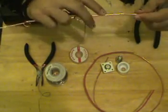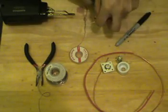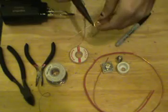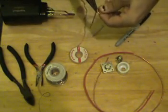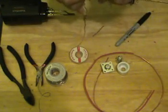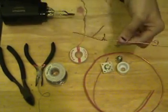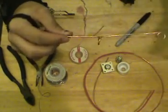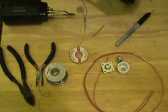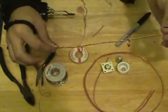I've got both of the coils put in place, and I've marked off almost 85 millimeters — between 83 and 85 mil — and I'm going to go ahead and cut this scrap off. This is the meat of our antenna. We're going to take some needle nose pliers and bend the appropriate length downward. Try to get these as sharp as possible — if you can't, no big deal. Give it a nice sharp twist up, and there's our first coil. Go into the second one and do the same. Got both coils placed — this is going to be the top end, and this is going to be the bottom end. That's the meat of the antenna.